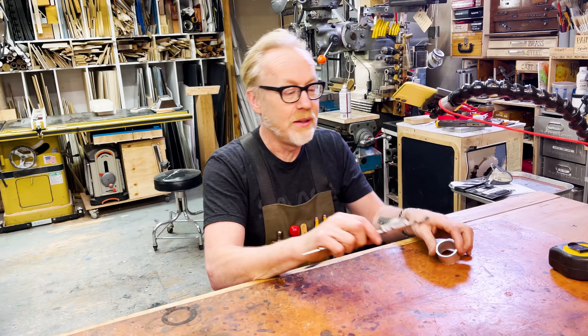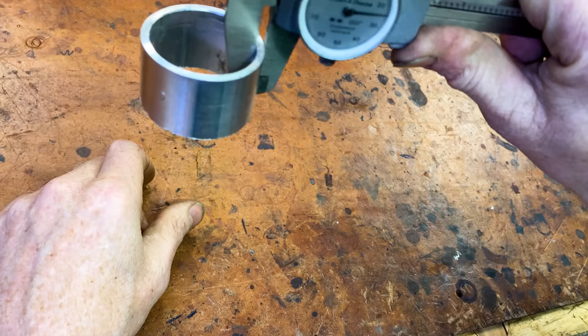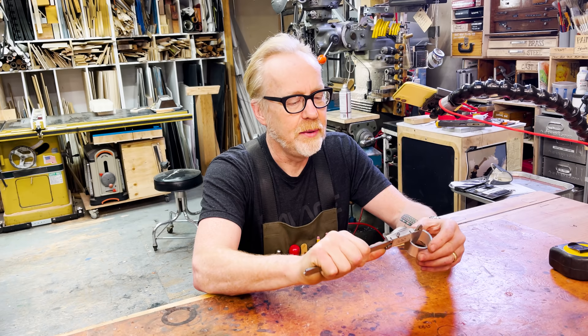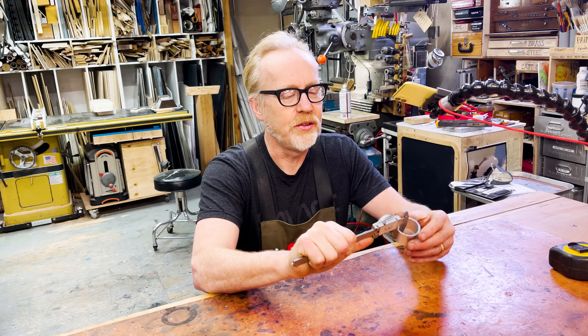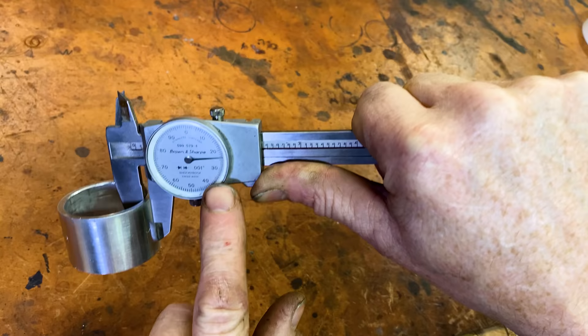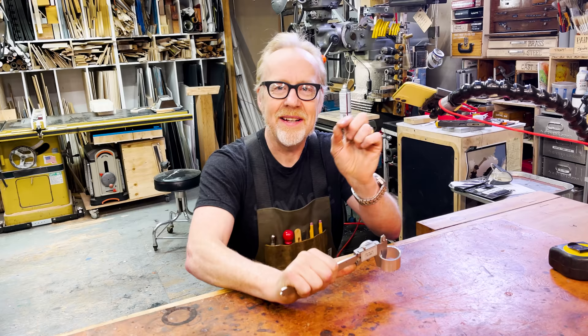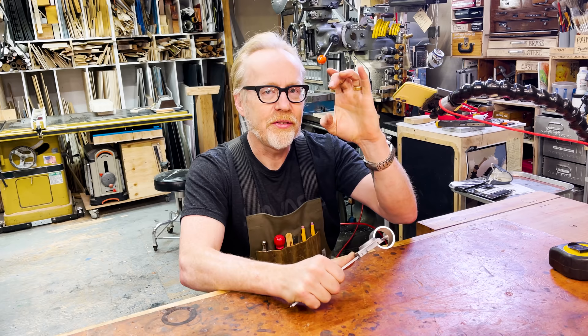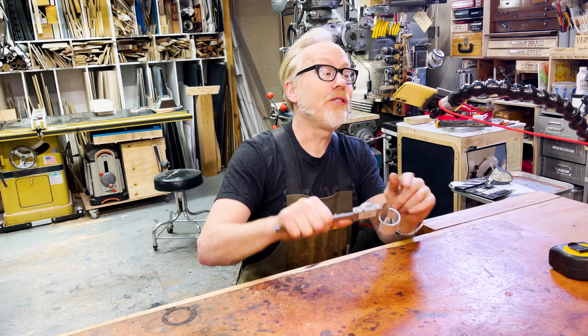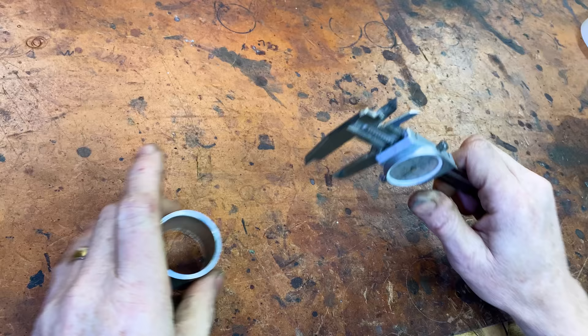Let me talk about why there are limitations to this. If I wanted to measure the wall thickness of this piece of aluminum, right now it says it's 0.125 — or an eighth of an inch thick. But here's the issue: when you look at the inside where the jaw is, the jaw is square and it's not matching the radius of the pipe, which means there's a tiny little gap between the corners of the jaw and the inside of the pipe. There are specific micrometers meant for measuring the wall thickness of pipes whose internal jaw is a cylinder that allows it to touch the inside surface.